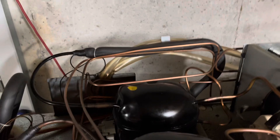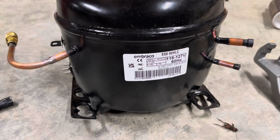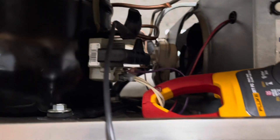If you look on the back side of the motor — let me try to get up here, I don't want to fall — I think it's supposed to be like nine amps is the most it's supposed to pull. I've got the same motor, same compressor over here, so let me unplug this. The replacement compressor is new — I did take it out of the box — and it's 9.3; you cannot go over 9.3 amps or the compressor quits. It's already been drained and evacuated.